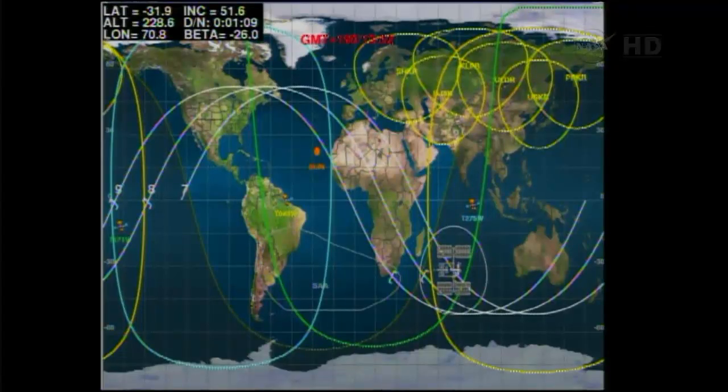Running torque backing off. It took about 10 turns for the running torque to back off. That's good for us to know on the install. Yeah, good call, Chris. We copy. How about it? 14 and a half turns. Shane, make a note. We can expect the first 4, 5, 6 turns to be low and the last 10 turns to be in the 10 or 11 foot-pound range on the install. Copy, Chris. We think it might be a little different just due to the different nuts on the other side. But we'll put that down and remind you when you get there. Copy that. And you guys probably can tell, but the sun is setting here in a few seconds.